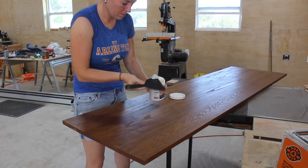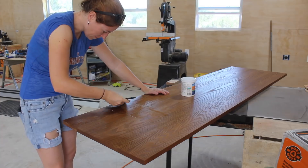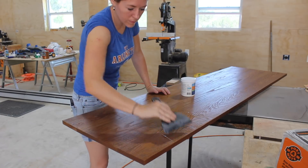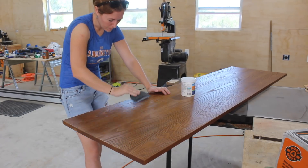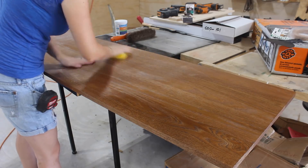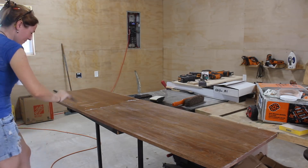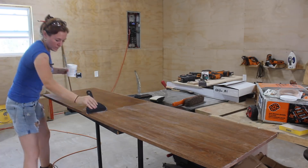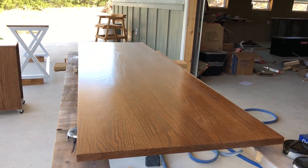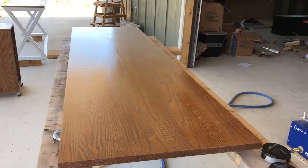The next day, I applied a product that absolutely blew me away because of how effective it was — it's called Grain Filler and it's made by Aqua Coat. With oak being such an open-grain wood, no matter how much you sand, the grain will always have inconsistencies to the look and feel. The purpose of the grain filler is to fill in the low spots of the grain so that once it's dry, it leaves the wood feeling as smooth as any other closed-grain wood. I applied it using a six-inch putty knife, scooping out a small amount and dragging it across the grain. Once covering a portion of the top, I'd come back and squeegee off the excess, making sure to do this going with the grain. In total, I applied three coats, sanding very lightly in between each coat with 400-grit sandpaper. It's just amazing how much it looks like a sheet of glass.